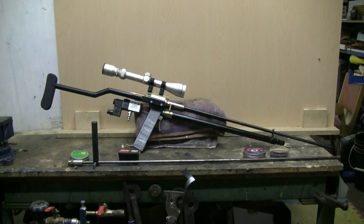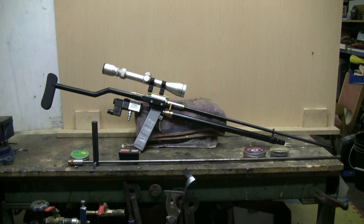With the 24-inch rifled Crossman barrel mounted, I get decent accuracy — I can easily hit a pop can at a measured 25 meters distance, so I'm happy with the accuracy. The 25-caliber barrel is not rifled, it's just a steel tube so I can shoot BBs through it. It's not as accurate, but no problem on my indoor 10-meter range.